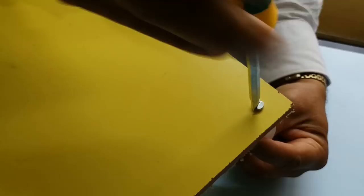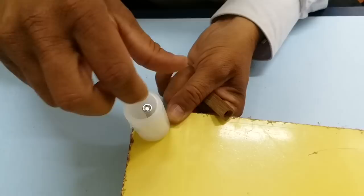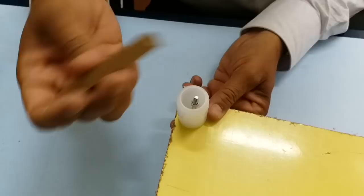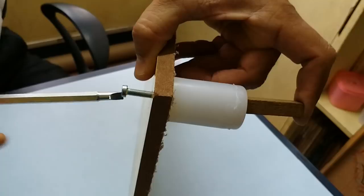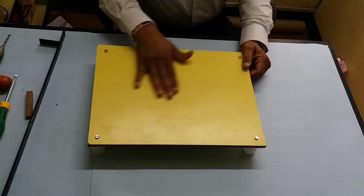Let me tell you how to use a nut holder for fixing the nut. Once you start, you can use your fingers until the limit is reached. Then insert the nut holder — the nut gets locked — and by holding the nut holder with your finger you can screw it till fully tightened. This is the easier way of fixing the bushes to the board. Now the board is ready with four bushes fixed at four corners and can be used for fixing the frame.